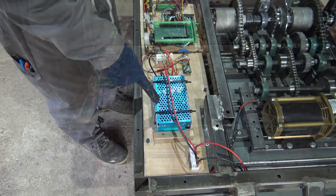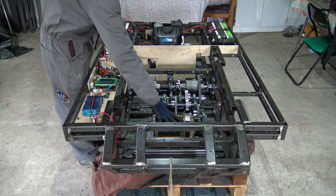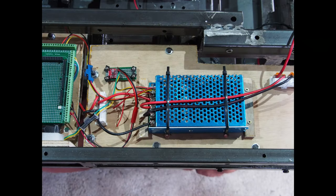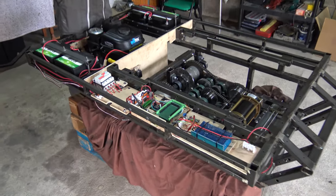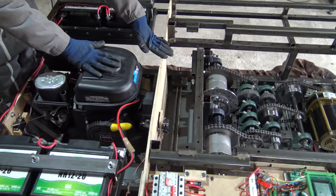This is the electric motor control unit. It provides the power for the electric motor and the rotation direction based on the signal from the Arduino board. I've added a dividing wall to separate the engine compartment from the rest of the tank as it will need to be air cooled later.